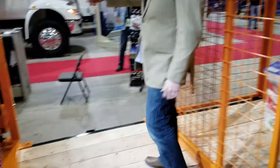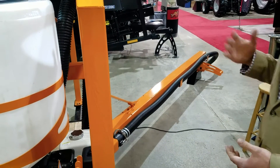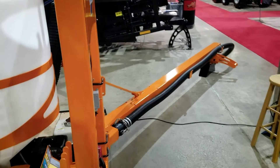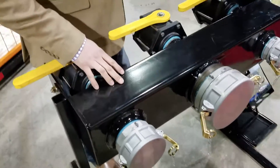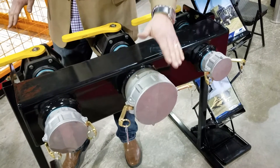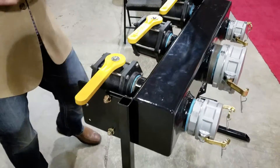Other options include a delivery boom with a latch system and handle and a cradle to sit into — push it down and it swings open, giving you about 26-27 feet of reach. There's also a high-flow manifold for managing tanks; all the ports are oversized internally for proper suction to feed a pump like what's running on this Dash system. It also gives you the option of 3-inch, 4-inch, or 6-inch fills so you can fill your unit back up and get back to the field. You can configure it to how you want — there are lighting kits and lots of different options.